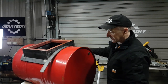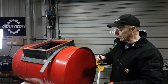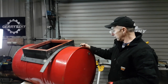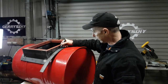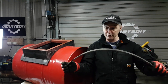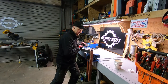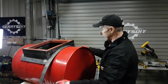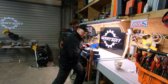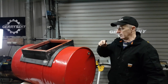The idea is that it goes there and follows the shape of the drum. It's partially doing it — I just need to get the ends down. I need to pull it a bit more in that section. I'm getting close enough now — I've got about an inch gap there, so from that mark down I just pull a bit more. It's looking pretty good now. I just need to chop it at that point, offer it up, tack it in position, and then weld the whole thing up.